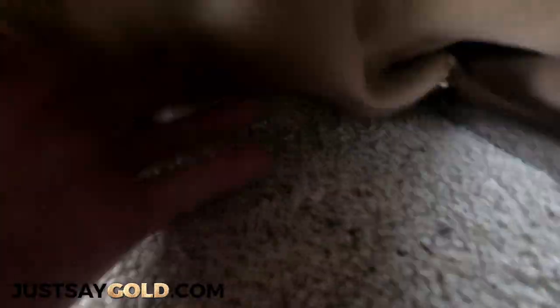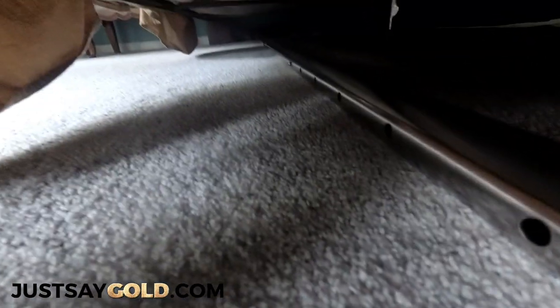Here I'll show you how to stretch carpet without moving the bed and bed frame. I put my stretcher under the bed all the way to the wall, then I'll do my stretch. After that I'll use my lift buddy to pick up the bed leg so the carpet can get pulled under it. If you have two people it makes this job even easier because one person can stretch while the other lifts the furniture.